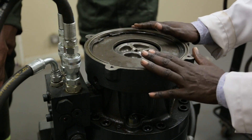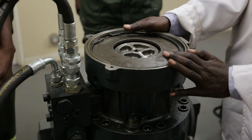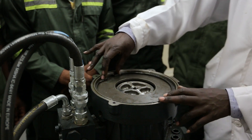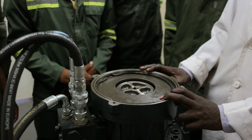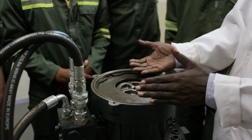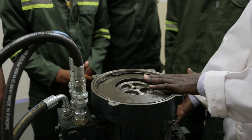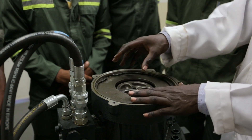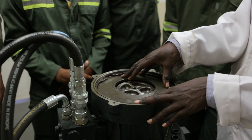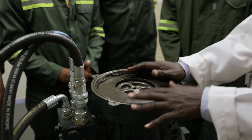That's why these motors are important in heavy equipment repair engineering. We shall use pliers and other gadgets which can help us remove the circlip. Once the circlip is removed, then we shall remove the preload which is causing the whole part to be stiff. After that, we shall try to lubricate it so that we free the components, and as we assemble, it will be able to turn freely.